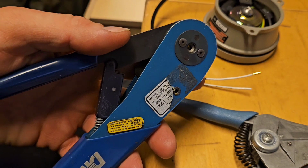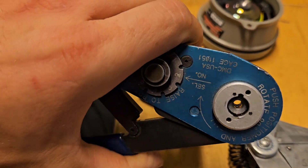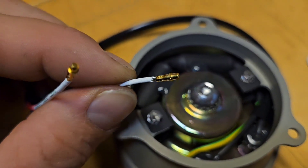The new horn comes without the contacts, so you need to crimp them onto the cable. For installation I use small DMC pliers. On the contact there is a small inspection hole — you always need to be sure that you can see the cable inside.